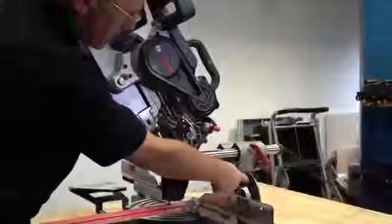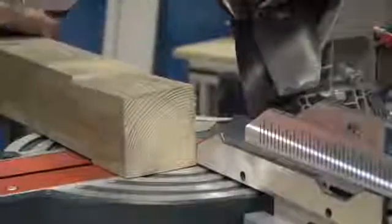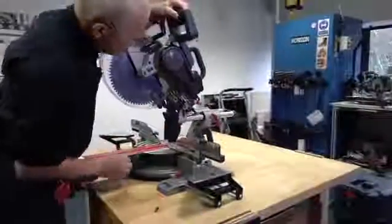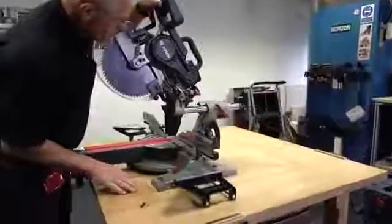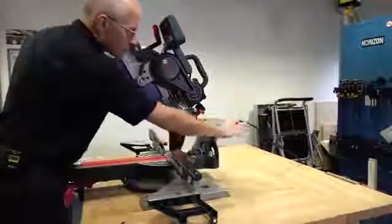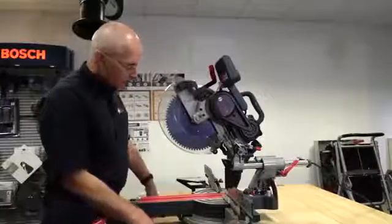Okay, usual quadrant at the back with a marker and a scale. But what's interesting is that you'll find on both sides a turret which is similar to what you'll find on a router. So we have the popular angles. We have 47, 45, 22.5, 33.9, which are commonly used bevel angles, and they're just selectable here by turning this dial. So if I set the 22.5, the angles are actually printed on the turret, so you can't really get that wrong. You in this case want to bevel over to this side, it just stops at 22.5 if that's what you want, and then you can turn this round to give you the usual 45, or the extra couple of degrees if you wish, 47. Lock the bevel by pushing the lever away from you, so it's very obvious, it's bright red and it's right there where you need it without fiddling around behind the machine, which is the case on some models out there.